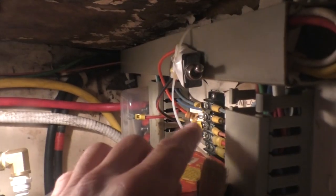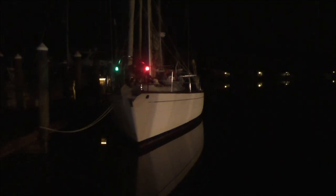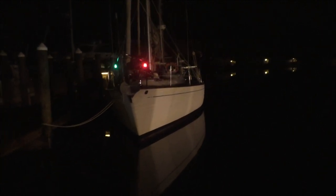That means it's time to figure out why the forward navigation lights aren't on. The battery shelf I was working in earlier had actually slid over and pinched some wires. I got in there and pulled it back off those wires — one of them was broken, and that wire was the navigation lights up front. I put bolts in that tray so it won't slide back over, but we'll get back in there and properly fix that wire another time. The quick fix was to borrow power from the cabin light circuit, put that on the switch, and that turns on our nav lights. Here's the new stainless steel piece fitting in — look how wide she is. That is a big beam on that boat — she's like the Spray, which was Joshua Slocum's boat, the first guy to sail solo around the world. That's it for us; tomorrow we set out to La Digue.